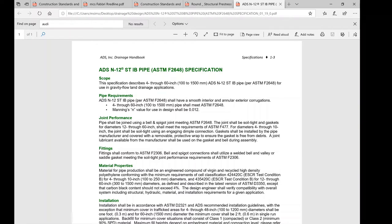Now let's look at drainage pipe. There are two basic types: HDPE, which stands for high-density polyethylene — a black corrugated plastic pipe, also called CPP (corrugated plastic pipe), corrugated on the outside for strength but smooth on the inside — and RCP, reinforced concrete pipe, which is precast concrete. The plastic pipe is definitely lightweight while the concrete pipe is extremely heavy. There's also a smoothness difference: concrete pipe feels rough like sidewalk, while plastic pipe is very smooth and stays that way.